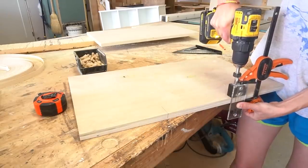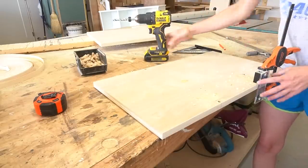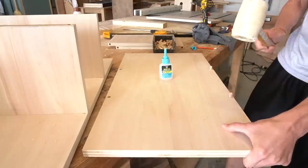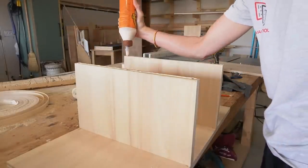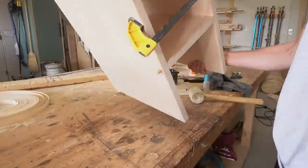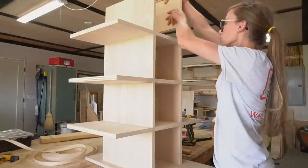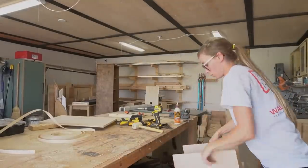You're welcome to use whatever method you feel most comfortable with, but for me it was dowels. I marked and drilled holes on the front and back edges of the vertical dividers for the shoe cubbies, then marked the center of the plywood shelves and drilled holes in those pieces as well. I measured, marked, and drilled out the holes with the intention that each cubby opening was to be 8 inches square. I used DAP Rapid Fuse glue to glue the dowels into the vertical panels, then wood glue to attach the shelves. I glued up one section at a time, letting them dry about an hour before moving on. Once I had them all glued up, it was 12 cubbies total.